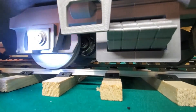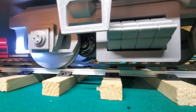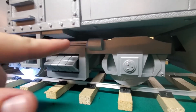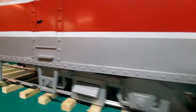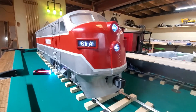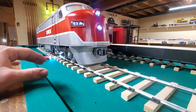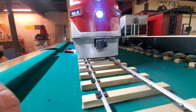There's the motor on the back side and the gear in there - that's a standard Tamiya motor. Actually, that is a high-turn, like an 85-turn RC four-wheel-drive 540 motor. These trucks I completely designed myself, 3D printed, and they sit on a bolster just like a normal one would. You can hear the fan going on the ESC as it's warming up. When you turn the power on the back it turns the lights on and lights up the number boards. I've got some computer speakers and I want to put a sound card in there because I've got to have the train horn and that diesel engine rumbling sound.